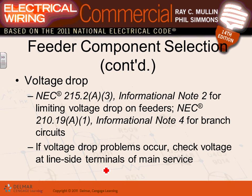So can I get you guys to understand that when you start building your riser, with your receptacle panels, Matt, and your lighting panels, you are almost always sitting at a 225 amp panel. If you need more, what do you do? You just add another panel. Can I get you guys to understand that one? Then you pull a full neutral with them. You don't derate the neutral up to a 225 amp panel. That will take care of your harmonics from lights, not heavily harmonic, just lights, and the harmonics that come out of laptops that you plug into your receptacles.